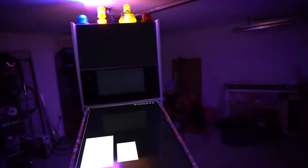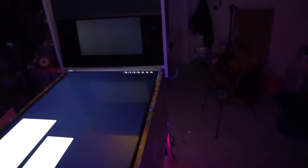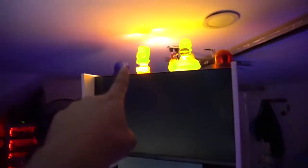Channel 13 is the shaker motor — let's skip that. Channel 14 is the R channel in RGB flashers. My automotive lights are red and blue LED automotive strip lights. I'm gonna show you the bottom again — it's got red and blue in it, so it is the red channel. Let me look at how many red channels I have: one on the top left. So that's R — there's one, two, and underneath the cabinet one in the back left. That's three, and one more there — that's four.